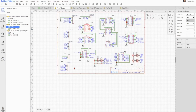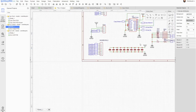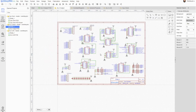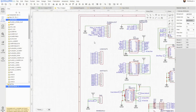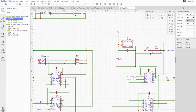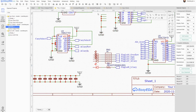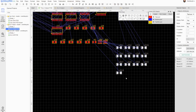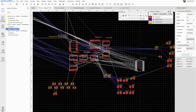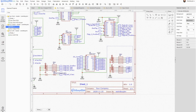Okay, so we want a decoupling cap by all of these, plus one larger one for the board. Don't like leaving half a chip unused. Okay, I think that should be done. Look, wrong LEDs. Look at these nicer devices with the annotation on to show which way round they go. Okay, I don't like the way that happens.